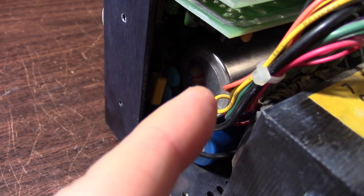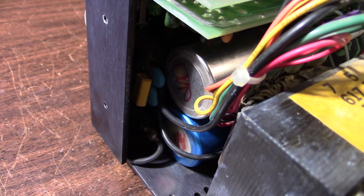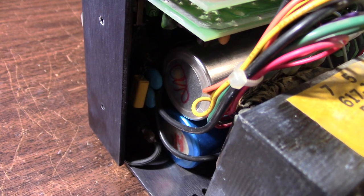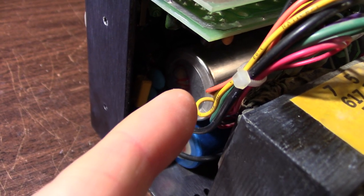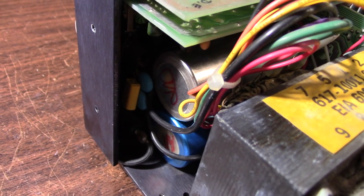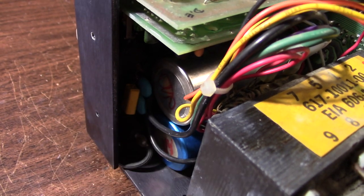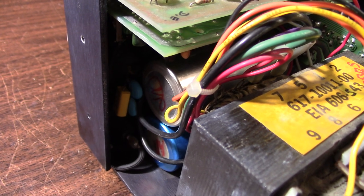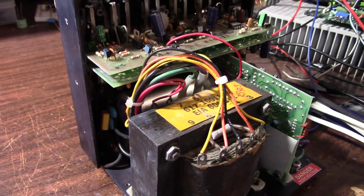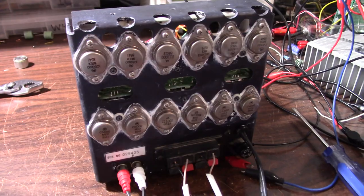I'm using the cap from the other amp — not the best shape, it's down quite a bit on capacitance and up a little on ESR, but it'll work well enough for a basic go/no-go test. I did find replacement caps for $20 a piece, so if I buy two for this amp and two for the other, that's about $80. I'm going to buy just one for now because money's a bit tight going into what I think is a recession, though that might get a handle on the crazy inflation — commodity prices are starting to fall quite a bit.